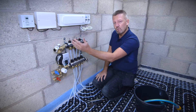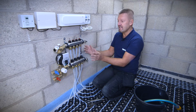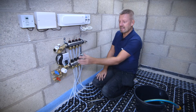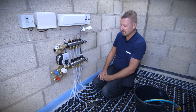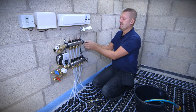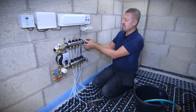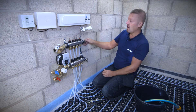We've put the water temperature control and pump set on the left-hand side because that's where the pipework's coming in, but it's very easy to orientate and put this on the right-hand side if you need to. The simple Uponor union connections allow you to swivel and move this to the other side and swap the manifold over. The fill and vent ports have got a little cap on the end — by undoing the cap you get a very small key, and the key operates the fill and vent port. You just need to open those fill and vent ports and attach a hose to them.